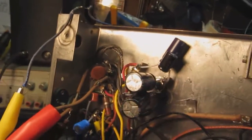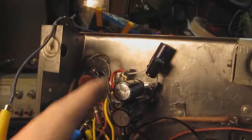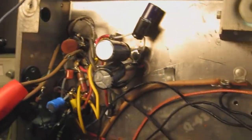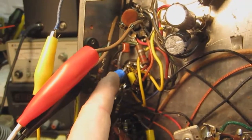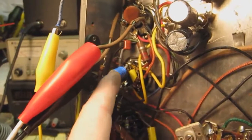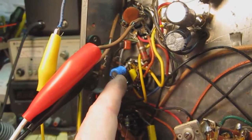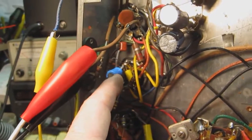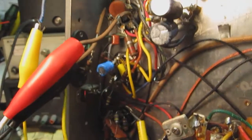So anyway, I just took those two terminal strips that I soldered on here and I used them to connect new caps, to give a stable point to solder in the new caps, which I did. And in this case, I just used two of the normal tube pins that this cap went to solder here and make this cathode bypass 20 microfarad at 25 volt cap here.